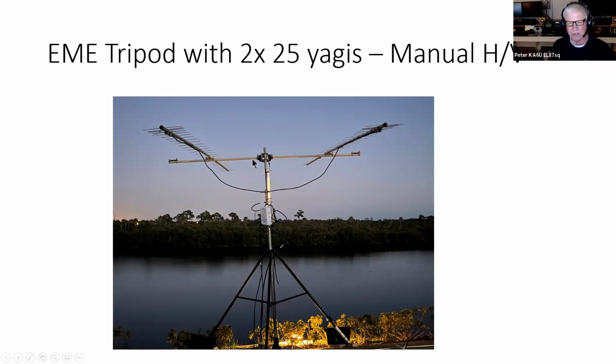And then the elevation rotator hooks up. This is a 1.5-inch solid fiberglass pole, so it's very stiff, not too heavy. And this is the mounting location for the 70-centimeter antennas, and then both the 2-meter EME antennas and the 222 antennas. This is the right spacing for those antennas. So I can run to 82 degrees elevation, and everything still clears the way I have things set up. And I can set this mast up from when I park the truck until this is set up in 10 minutes. And that's a big improvement. It used to be 45 minutes. So again, it's the incremental improvement.